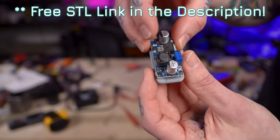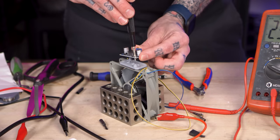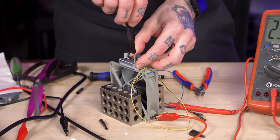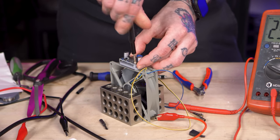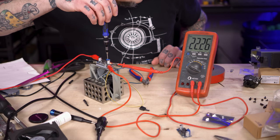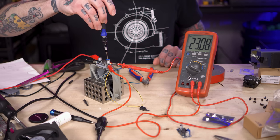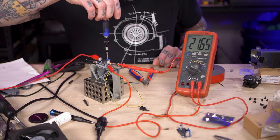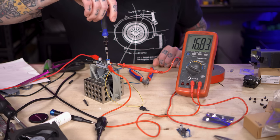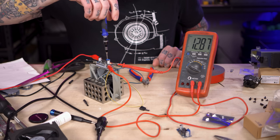There's a link in the description to download a file for this mount piece. I chose to double-sided tape it to the side of the Noctua fan, then mounted the buck converter with a single M3 screw, and then dialed it in. I used an external power supply set to 24 volts so I could adjust the output voltage before ever connecting the fan to it — that way I don't overdrive the fan. I always recommend doing this: don't connect your fan until you have confirmed your output voltage is set correctly and you're not going to harm your fan.